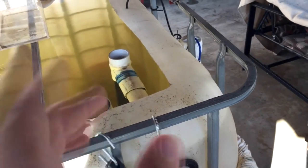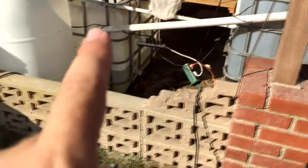And the fact that there's a hole there, it basically doesn't start a siphon and then just drain this whole tank. So it comes out of here, goes down this pipe, and goes back into the sump.